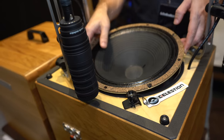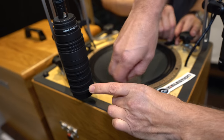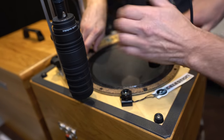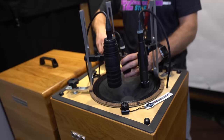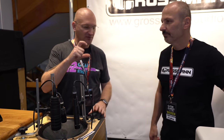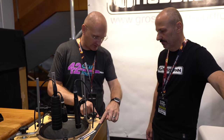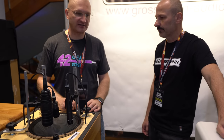That's what you people think, but foam and egg cartons don't help to make it quiet. They're for diffusion and high frequency dampening. The only way you can get something to be actually quiet is to throw weight at it. Stuff has to be heavy so that sound doesn't move it. That's physics, there's no way around. Which is why my isocaps are actually made out of kitchen countertops, the thick ones. All that screwed together, then on the lids you have foam, or like I have window sealer. And inside I have heavy foam, but that's just for the inside sound.